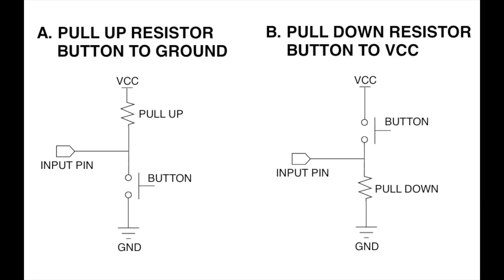As far as how to wire up the buttons on the game controller, this is an issue that has come up a few times. Looking at the image shared, we have two different scenarios with a momentary button — the buttons on the controller are momentary: when you push them down they close, when you let them up they open. In version A, the circuit has a pull-up resistor — pulled up to the voltage rail, which in this case is 3.3 volts — and the other side of that resistor goes directly to the I/O input. When the button is left open, the resistor pulls the input high, so the input sees a logic one.